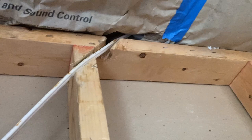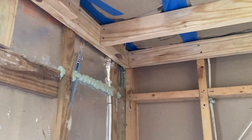All these wires here, this is non-load bearing, none of that. I notched that out so I could go over it with my Dura-Rock. What I did, I framed out for the soffit so I can have something to hook the drywall to. Just 3 2x4s and blocked it in a little bit there so I could get a little bit more on it.